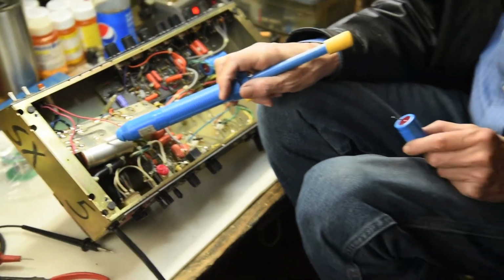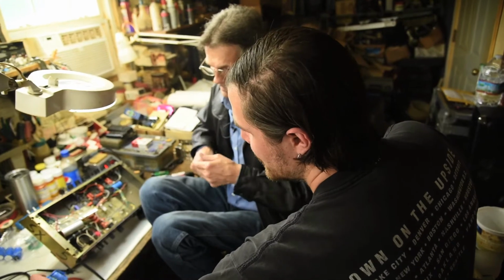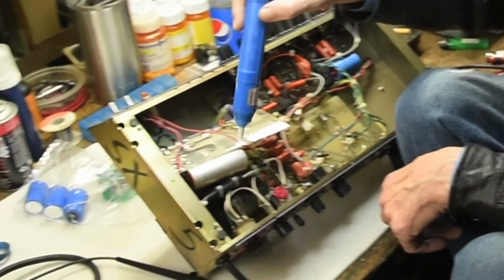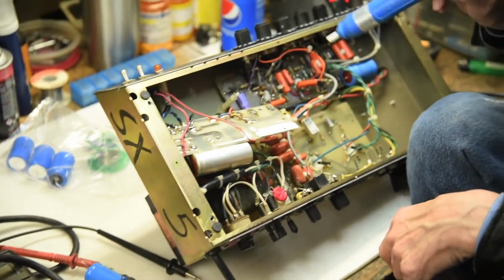Nice. These are the two that get hit by the voltage when you first flip the amp on, and it takes that extra amount of voltage out of the amp, you know, where it doesn't tear it up. If you just hit these with all that voltage at one time, you'd pop one every now and then. So when it runs in series, it'll handle double the voltage, and then like one side's negative and one side's positive. So does the positive wave hit the? The negative side of this right here is coming from the transformer. It goes through the other one to the positive, and then it'll go to each one of these. Each one of these will go to two of these tubes.